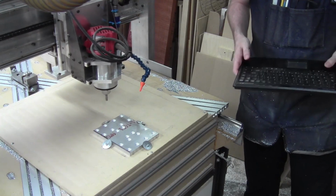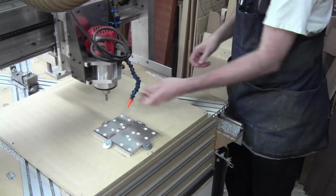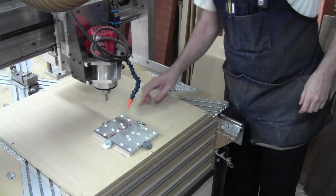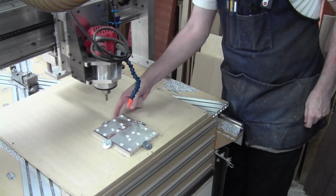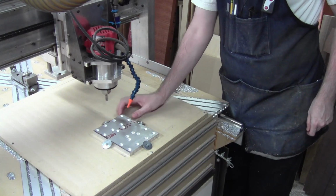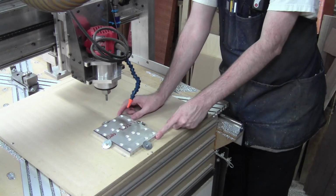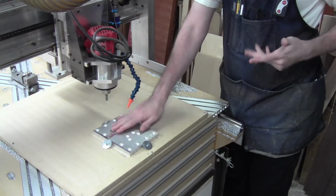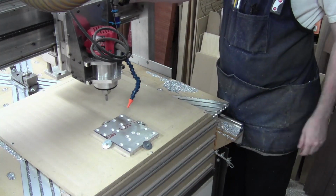and then we'll switch out to the V cutter and get it ready for marking where all the holes go, and then I'll drill a couple so I can mount it, and then we can do the outer profile. These counterbore locations are quite close to this edge, so I have a feeling I'm going to cut this edge again. Maybe. I'm not entirely certain why that's continuing to happen. I have the dimensions of this workpiece in my CAM, and I centered the model, so why this isn't coming out centered, I'm a little unsure. Well, I'll go back and check, but for now I'm going to cool this part off so I don't have any troubles with profiling later, and I'll bring you back here in a second.